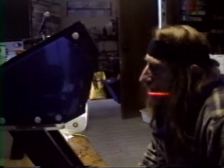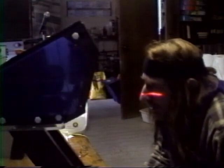Laser light intensity is rated at half a milliwatt, which is considered eye-safe — or perhaps I'm blind to the danger. The profiles look like those found in triangulation, but they differ in a couple of respects. They have no perspective foreshortening, and the illumination stripe is collimated so that it's a uniform width no matter what depth is being probed.